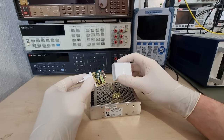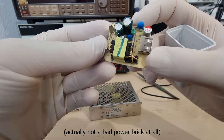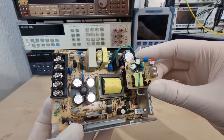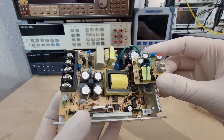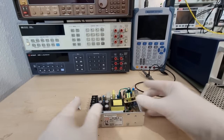The interwinding capacitance is much worse with the ultra-miniature transformer in the cheap power brick — would you look at this little guy — as opposed to the reasonably dimensioned part in the MeanWell PSU. Following this, I would postulate that DC-to-DC converters with the highest available withstanding isolation voltages could also be very good common mode performers. Does anybody remember what kind of parts we had to use while building CERN's digitizer?